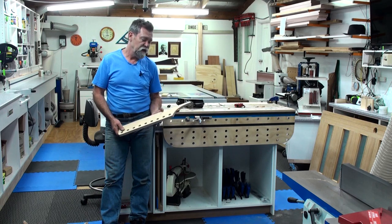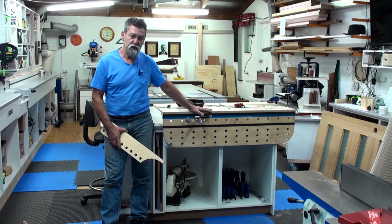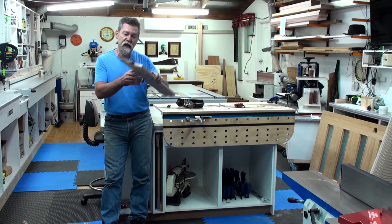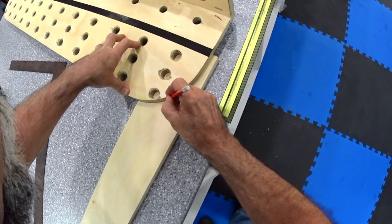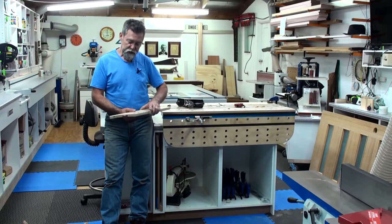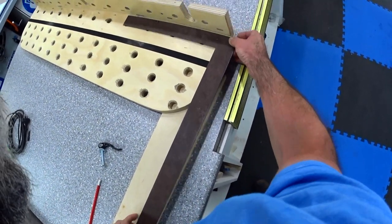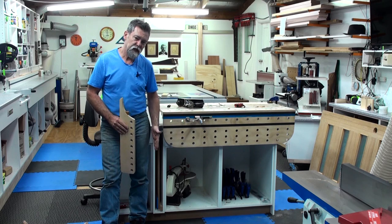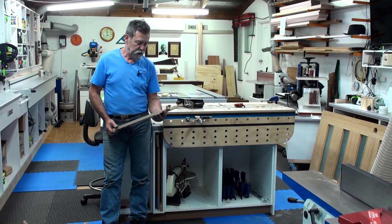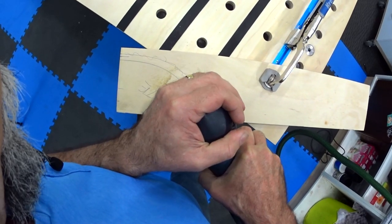The stationary deadman is a piece of three-quarter inch ply — hoop ply. First thing I did was take the skirt off the Stanton bench, then I turned the skirt upside down, face down, placed the deadman underneath, and scribed around where it was going to sit. I used a roofing square or large square to make sure it was perpendicular to the ground and perpendicular to the bench.